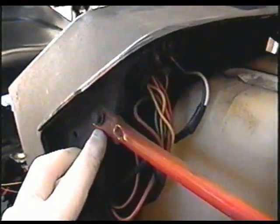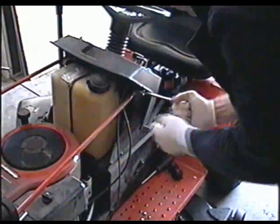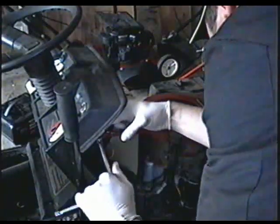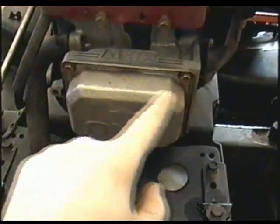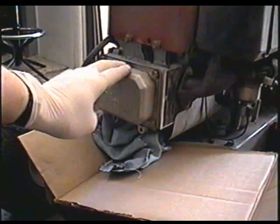Now we're going to take off the front end of the tractor so that we can access the valve cover in the front better. I'm going to start by removing the bolt over here — there's one on the other side and one over here that needs to be removed, and the same on the other side. The two bolts on the sides of the tractor are three-eighths. Now that we've got the hood off, we're going to remove the valve cover by removing the four bolts here. Before you get started you may want to put a rag underneath and a piece of cardboard, because when you take the cover off some oil is going to come out.